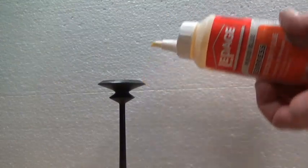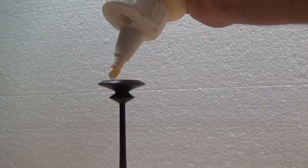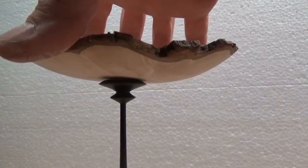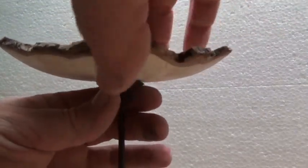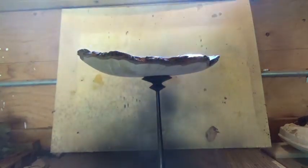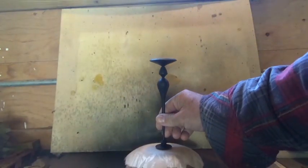I want to paint the stem black so it contrasts really well with the maple. Now I'm going to test fit the top before I glue it — looks good. I've got some LePage glue which is very much like Titebond, and I also use Titebond at times. A nice dab of that on the top, then align them up and push it in home with a little twist so it's in there nicely and the glue is well adhered. Now that it's dry, I take it outside to put some clear spray lacquer on the whole piece. Thanks for watching — don't forget to like, share, and subscribe, and I'll see you again for the next woodturning project.